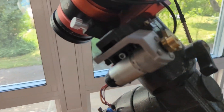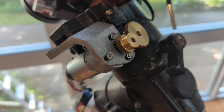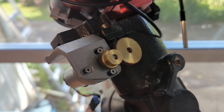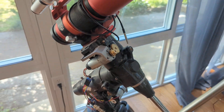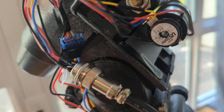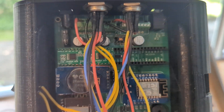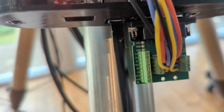This is OnStep but with servo motors, not stepper motors - still a highly beta experimental section of OnStep, but I wanted to give it a try. These are the stock motors of the CG5. Everything is just CG5. I've got the wiring - four wires for encoders, two wires for DC into the motors. We've got Howard's DC stick in place of stepper drivers.